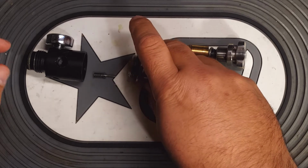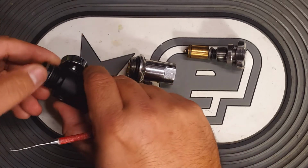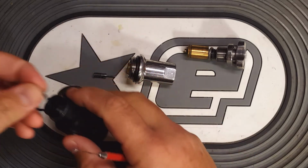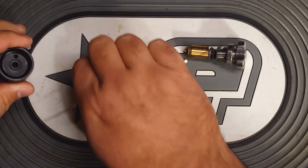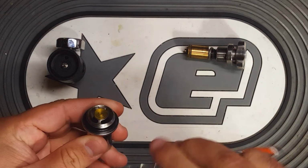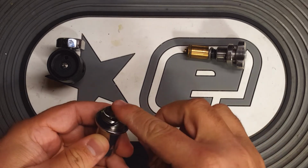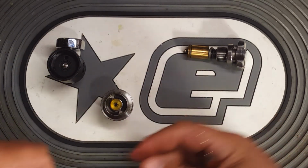Alright, now we're going to go ahead and replace the O-rings on this system that can be replaced. Obviously you have the one on top here, which is a standard tank ring. It's a 015. Is that one a new 015? That can be a 70 or a 90 duro. I'm going to put the pin back inside here, spring side first. The puck on this one is good, so we're not going to touch it. But all you need to do is basically take a pick and pop it out, and there's a little groove where that puck will reseat once you put a new one in. This large O-ring around the outside, which also very rarely needs to get replaced, is a 116.